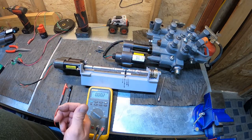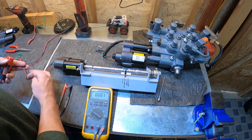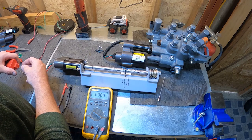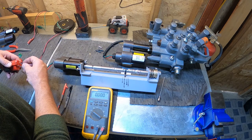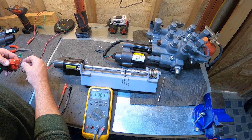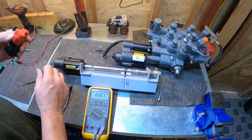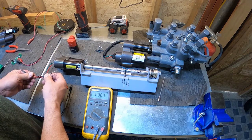So we could just use a battery. I just use little Milwaukee 12 volt batteries. If we wanted to test the motor, we could just take your motor leads and see that it's spring centered. But if you hook it to your battery, it just goes full stroke and holds. There's no fine adjustment in that. So that's what the potentiometer is for. Tell us where it's at.